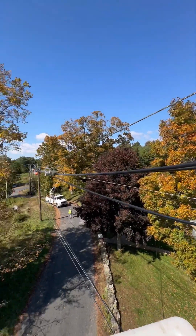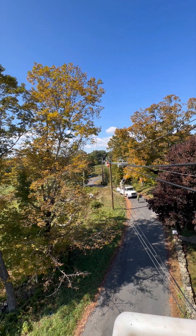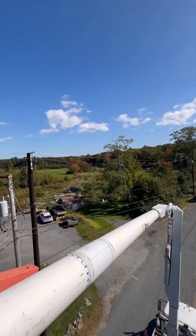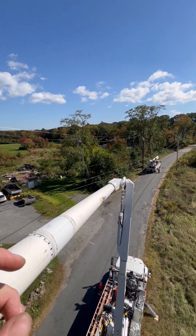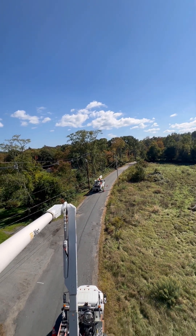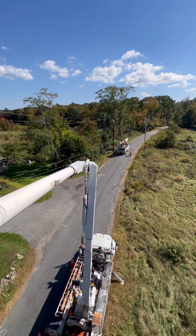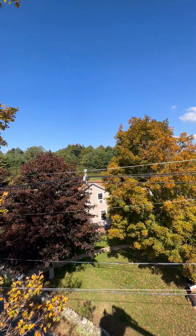We got all the slack out of the rollers — our slackies are taken up. Flat Stanley is bouncing the wire, taking his measurement. There it is — tight in. There's our spacer. You might ask yourself how do you know where to get all the rollers and have them all even. If you look on the ground, you can see spray-painted marks every 30 feet — a white line — and that correlates with the roller. Each roller gets a spacer.